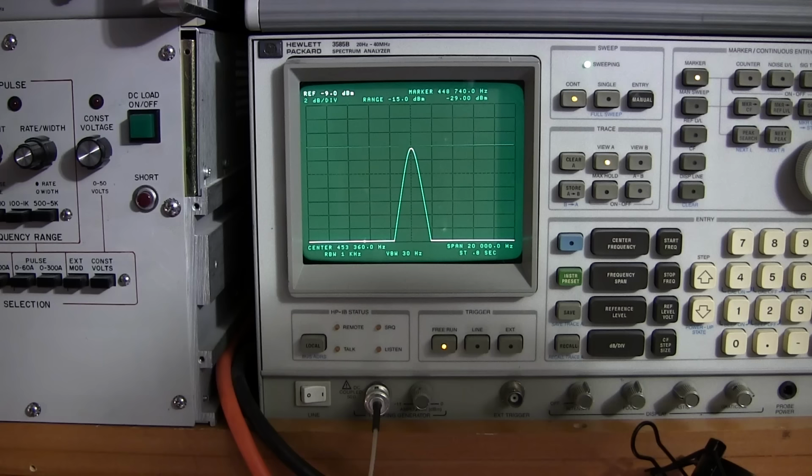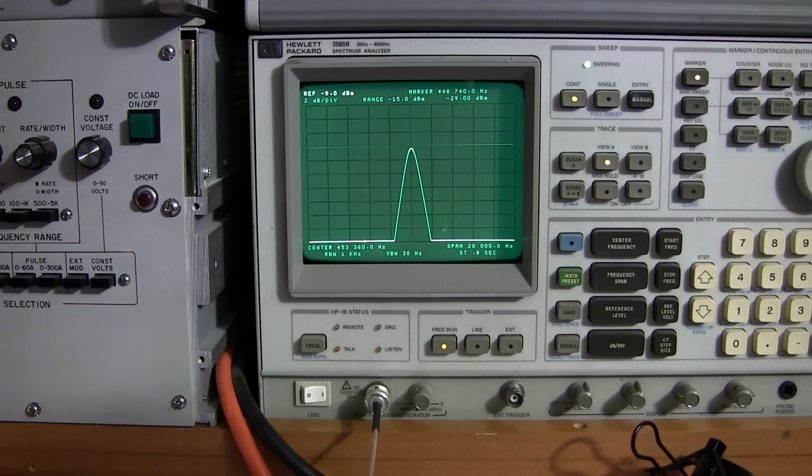So tuning the crystal selectivity, again, just that one control, which is L2. I really don't want to fiddle with that right now and show you the differences. Just touching that control completely changes this. It's that incredibly finicky. It is.